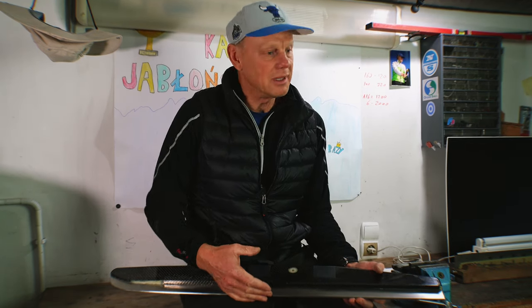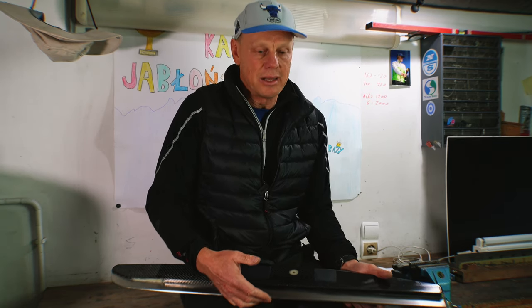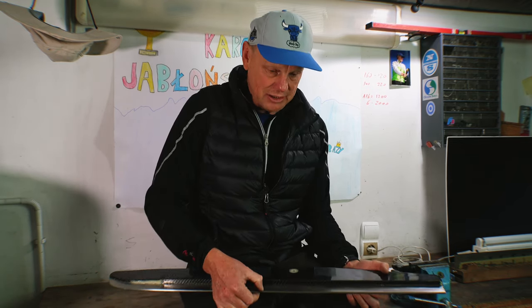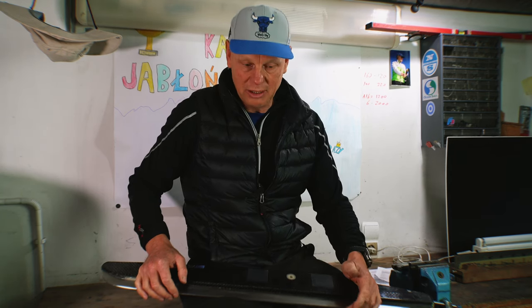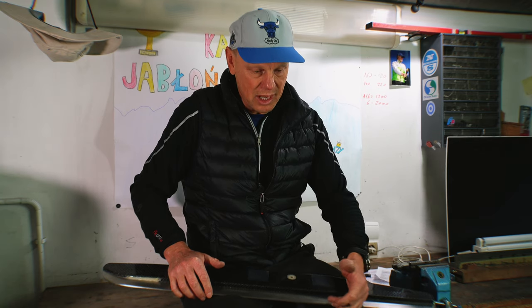Because I tell you, if you check the crown now, here inside, at 15 degrees, and then you cool the runners down to -5, there will definitely be a change in the crown. It is important to check the crown in the temperature range when you are going to use them. Because there will be a different crown requirement for runners which you want to use in -10, -15 degrees, or on ice which is covered by water.